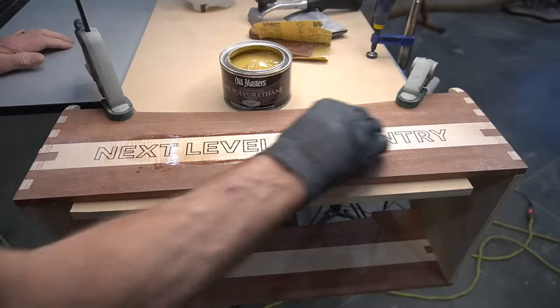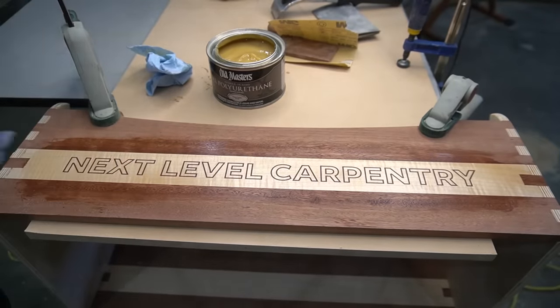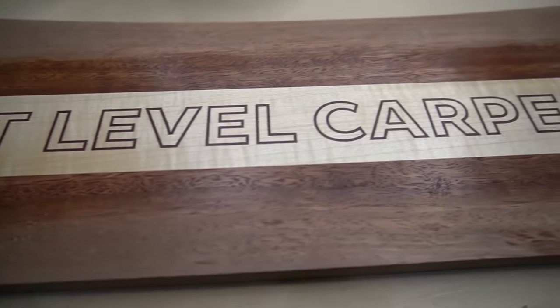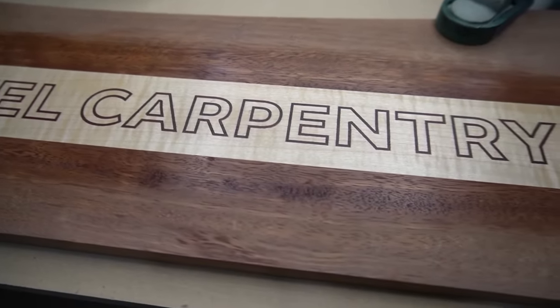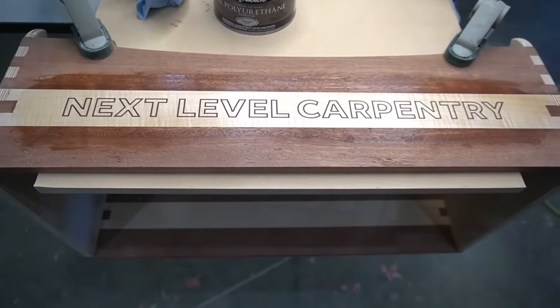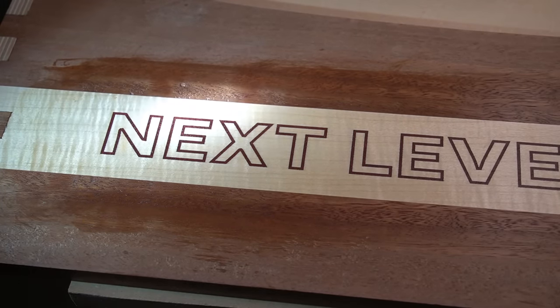and add icing to the cake with an initial coat of gel poly, where you can see the lettering is crisp and clean against the maple background and has a subtle but distinct deep red hue from the ruby mica powder that complements a similar deep red hue of the cocobolo wood on the tool tote sides. The mica powder is a bit more visible when I supplement poor shop lighting with a flashlight, but I'm 100% pleased with the results.